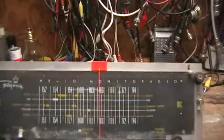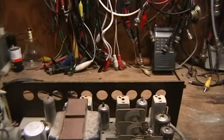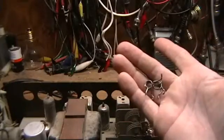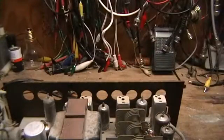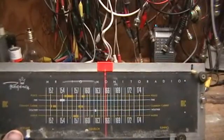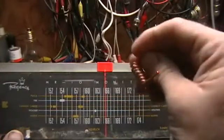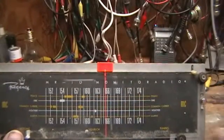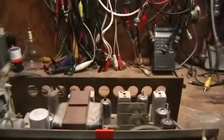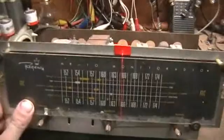And that's exactly what I have just done with this unit — moved it on down to the FM broadcast band, and the old inductor is here. Basically, all it'll cost you for repurposing this radio down to an FM radio is just a little bit of scrap copper wire and basically no real cost besides time. I'll plug it in and let you hear what it sounds like.